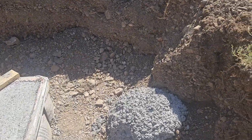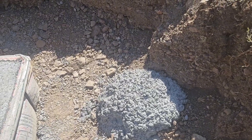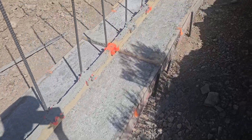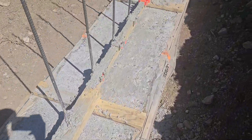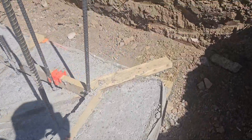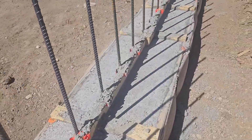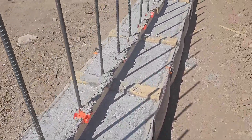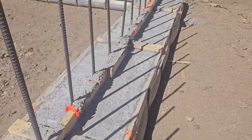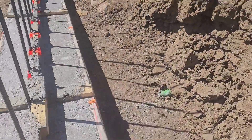Here's the morning after our pour. For some reason we got pretty close — this is all we had left, which is not ideal. It's supposed to have a yard and a half extra, so not sure what happened there. It's definitely pretty close across the top and looks like it's still drying. A couple of the vertical rebars moved on us while we were pouring, so we'll have to straighten some up, but it seems like they should all be pretty close on location to the centers of the fast wall block cores.